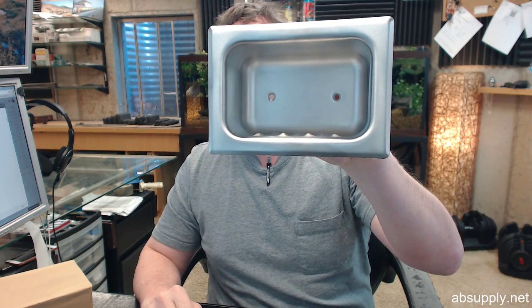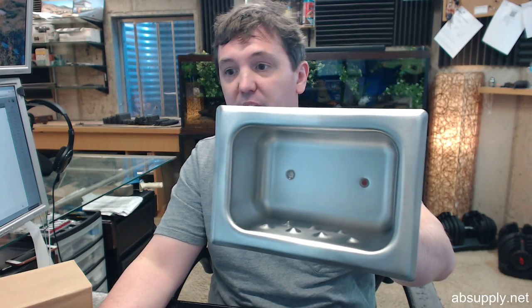And the A-clamp is used when you're installing it onto studs. You can search, there is a link below this video to the A-clamp, and actually what happens there is you're going to be able to attach or slide a clamp inside of the wall and draw this down onto the clamp, and as you tighten the screw, you draw the 2 pieces together, and it just sandwiches over the wall, the hollowed out wall sort of application. For drywall applications, they call it.